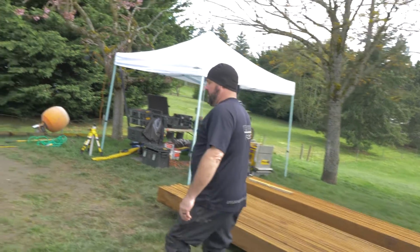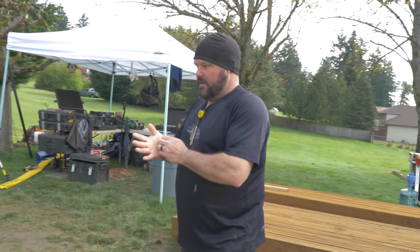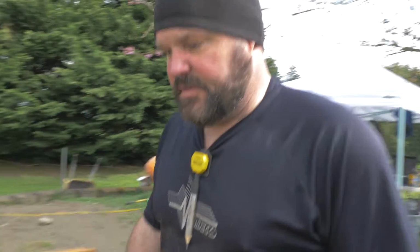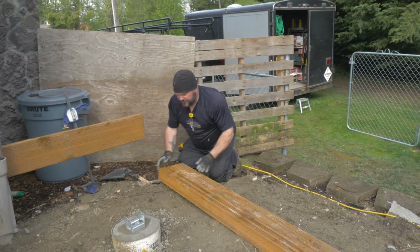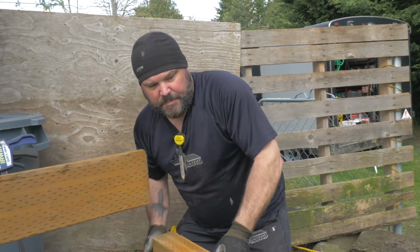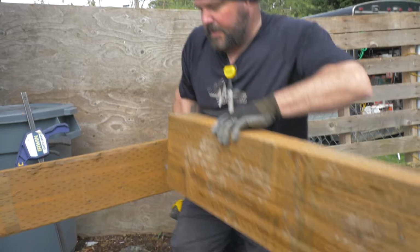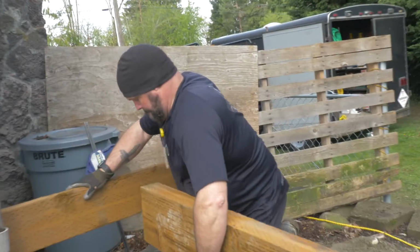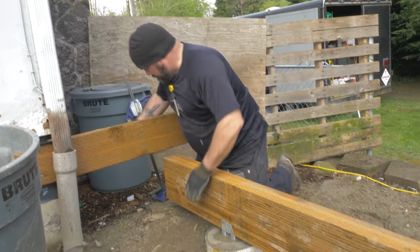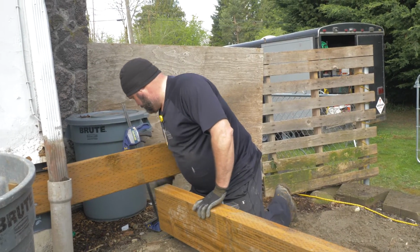But we got to finish getting our beams to elevation first. So you always grade your framing. Whenever you're getting ready to put in a beam or a joist, we always cup it up, bow it up. Okay, my way 1.5 inches. Whoa, too far. Whoa, right there.